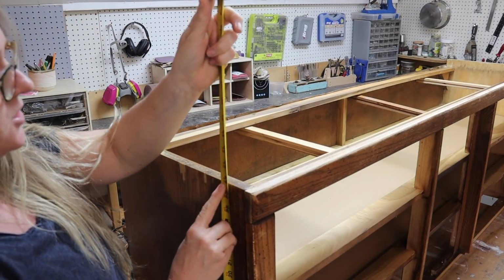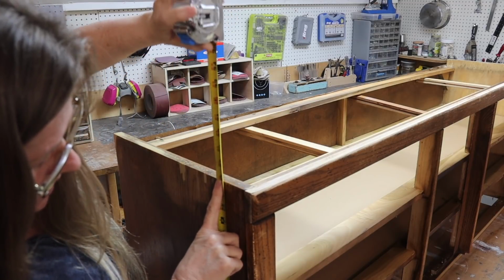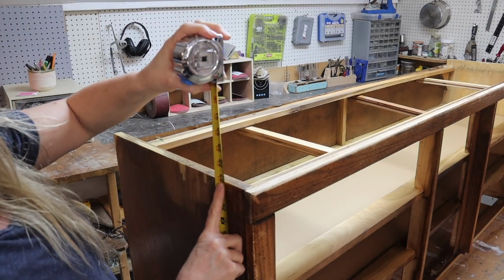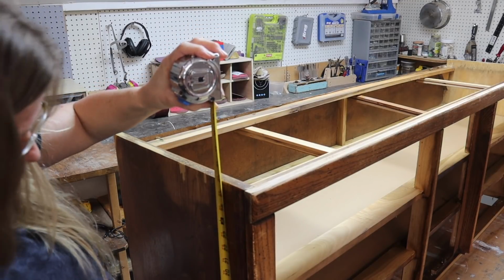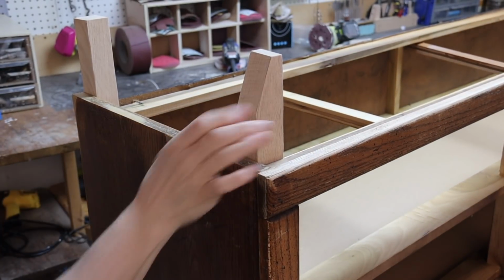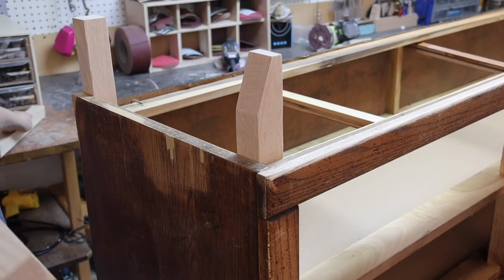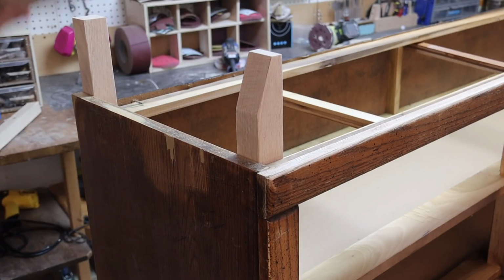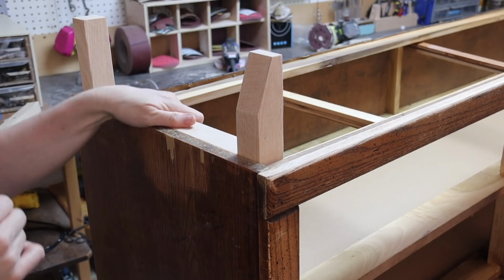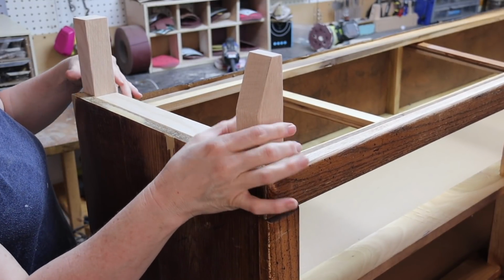This dresser actually comes just under 27 inches and a standard dresser can be anywhere from 26 to 44. I don't particularly want it 44 inches high. That's a tall boy. I have cut and sanded two of the front legs and two of the back legs. I have now cut an off-cut piece of scrap that I don't need, that I'm gonna be putting in between these two legs